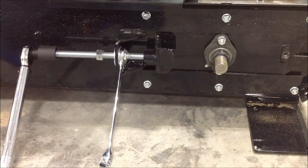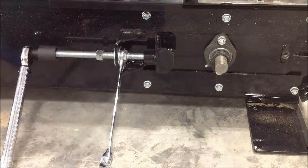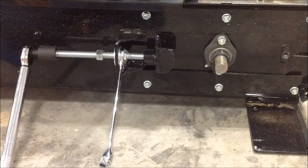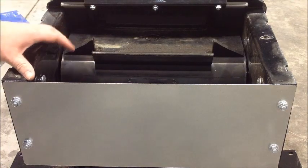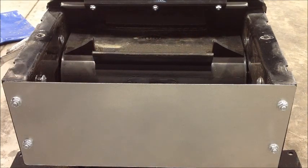Now I recommend running the conveyor for 10 to 15 seconds, then come in and look at the tracking of the belt. We'll adjust it from the second side only — we won't touch the other side because it was torqued, so we'll make our minor tracking adjustments from this side. We've moved back to examine the tracking on our belt. What you want to end up with is the same distance on both sides of the belt, and we do that by adjusting the tensioning on the second side.